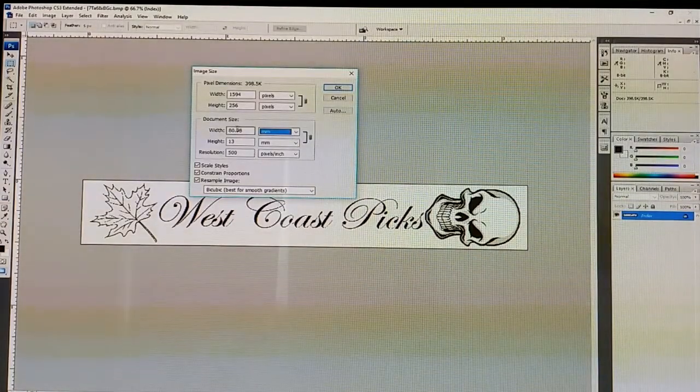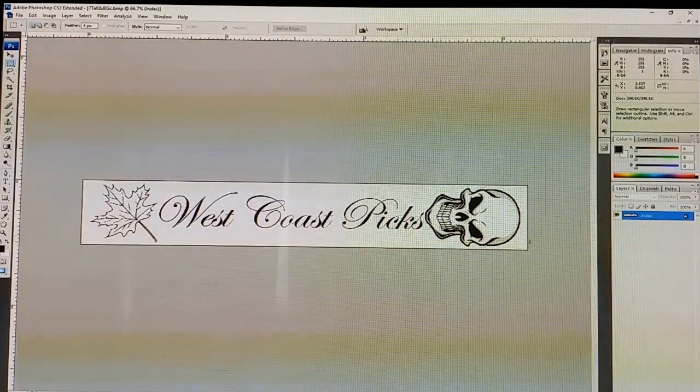So this is going to be a pick handle, and I leave a millimeter on either side for air, for when you're sanding and finishing when you're done. It's normally 80 by 12, but it's 81 by 13 millimeters. So you just got to remember that number. It's the exact one-to-one scale of what you're actually going to be making.